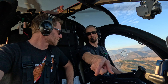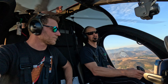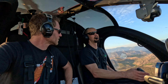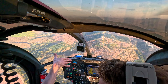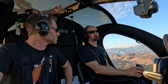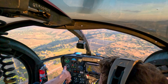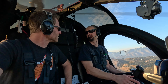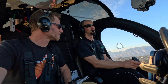It's going to scare the heck out of you — it snaps hard. I simulated it with the instructor. He's calling for more right pedal and I'm already at 35-40 degrees bank — it's just not natural to have that much right pedal. Circle harder, pull your turn tighter, slow down — we had to do all three bad things to make it happen. When it snaps it's going to put you nearly inverted because you're going slow. What you're going to do in a panic is pull back on the cyclic — and now you've made it worse. You're already having this tucking, snapping right turn, you're facing straight down. You were already at 40-35 knots and now you're at 25 knots. You're losing ETL, pointing straight down, going slow. You probably won't recover. The corrective action is left cyclic, left pedal — you'll get right out of it, unless you're at 150-200 feet AGL when it happens.